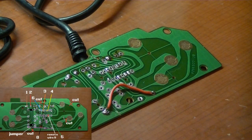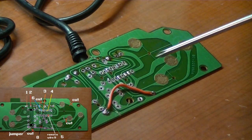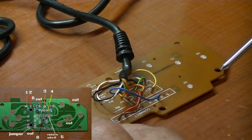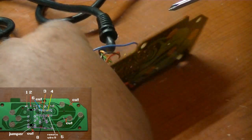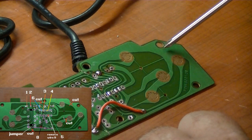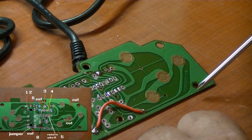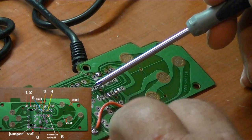All right, there's our bare circuit board yet again. Now, in order for this modification to work, I've got to connect two wires together through a switch, the green and yellow wires. So I'm going to use this switch up here. It's going to require me moving some wires here in the back. For example, I'm going to have to move wire 6 to another location, mainly because in order for me to use the start switch up here, I'm going to use this main bus right here in the circuit trace. Well, wire 6 is controlling that right now. So I'm going to move this over to another input, another pin on here, which ends up being right there. So I'll move wire 6 to this hole here.